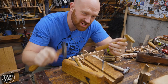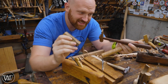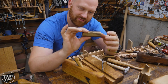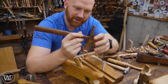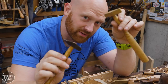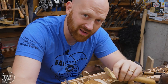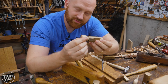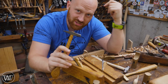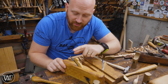There are many different traditions to woodworking, and because of that there are many different styles of plane setting hammers, and they come in all different shapes and sizes. The Japanese tended to have a more flat face on both ends. This is a London pattern — it has a couple different names — with a wedge down at the bottom. There are some that are very simple, some that are very fancy. They all have their own perfect uses. Many of them will also have a wooden face, though a lot come in brass or bronze, so you're not going to be hurting the steel, though many do actually come in steel.